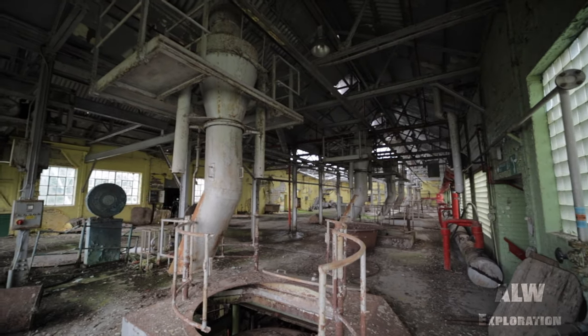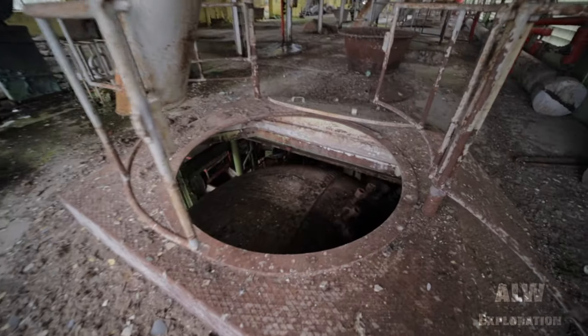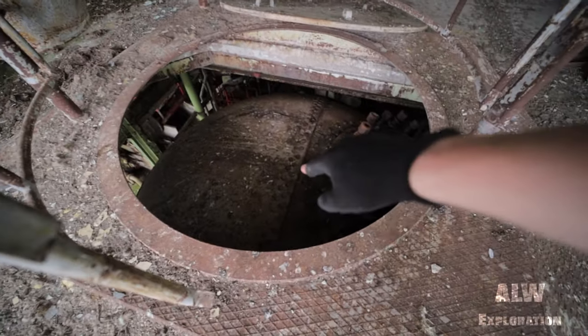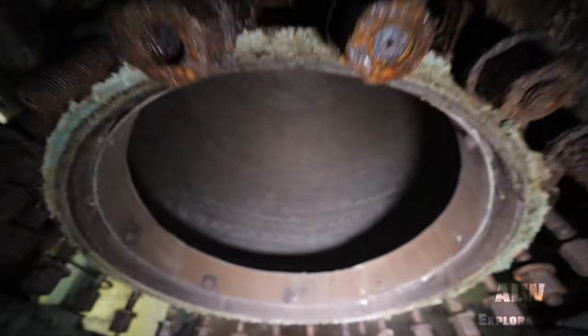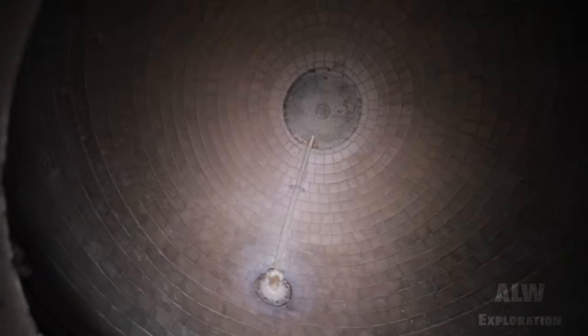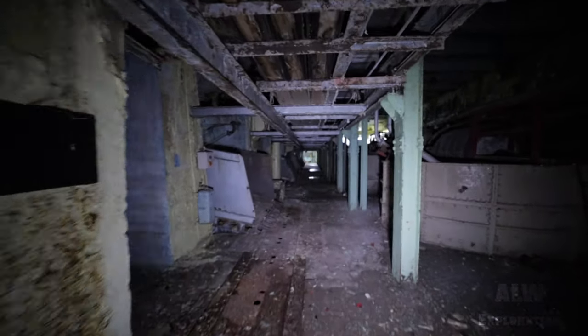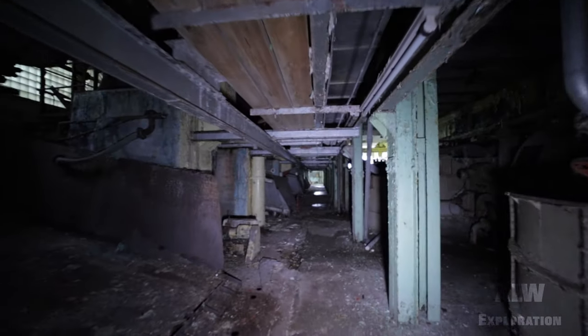When the digester had received its weight charge of fibre, a metered amount of alkali was added. Each digester holds 4 tons of chopped fibrous raw material, these pivotal pressure vessels each having a capacity of 20 cubic meters. There were 7 digesters along this row.